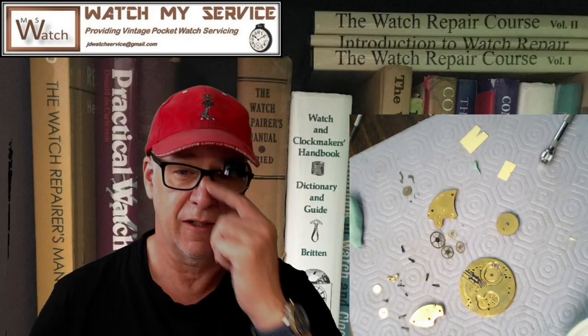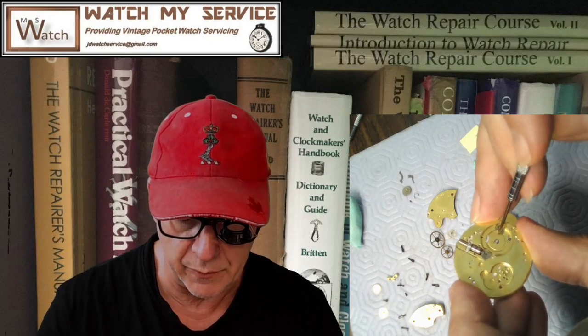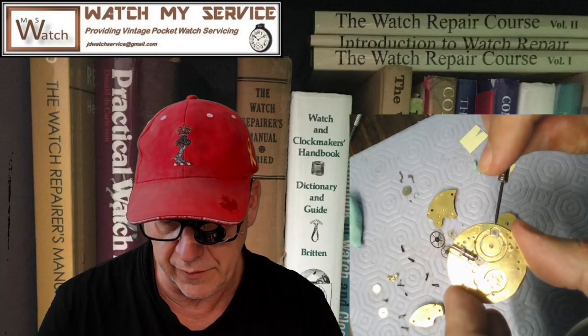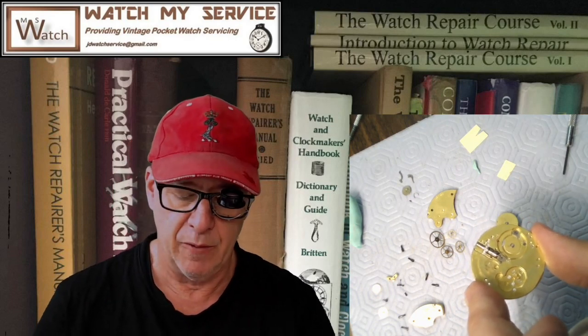When I tried to take the power off the mainspring it was almost impossible. I think I screwed up because there was this little tiny lever on the side that would sort of release the mainspring from its position — I think you stick a pin in a hole here. I didn't know that, so what I did was I secured the escapement so it was safe and took off the pallet fork and let the mainspring run down the train.